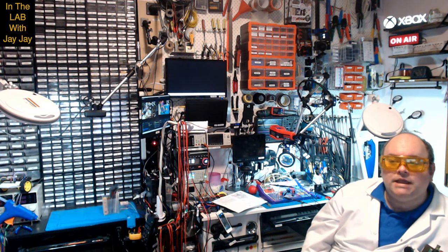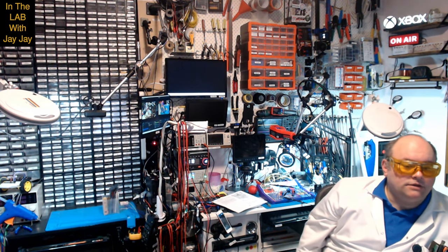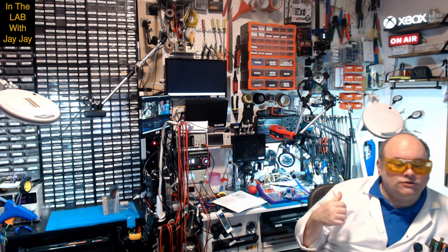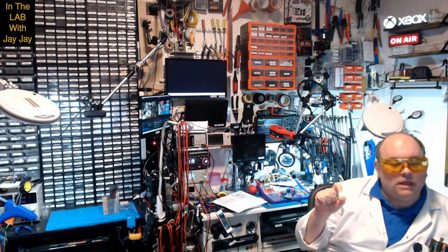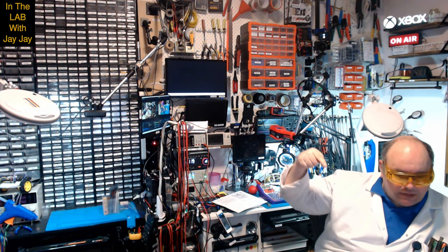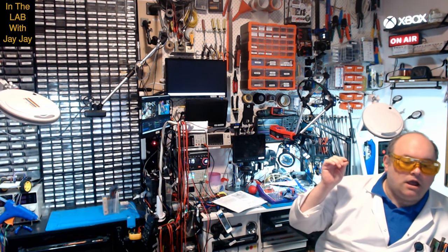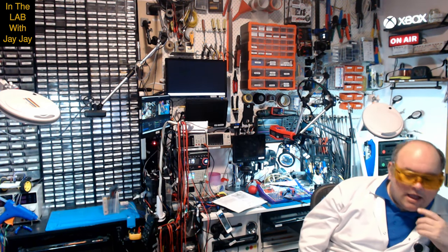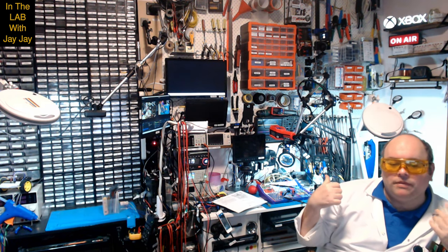I honestly haven't figured out how I should really go about attaching those banana plugs. I might do some research and see if I can figure it out. But I try the ferrules and that doesn't work. And then I try some spade crimp lugs and that doesn't work. And then I bend the crimp lugs in half and try to screw them in mechanically, and that doesn't work. And then the final thing that I do is I drown the lug in solder, and that did kind of work, but then the mechanical joints were no good on the particular application.